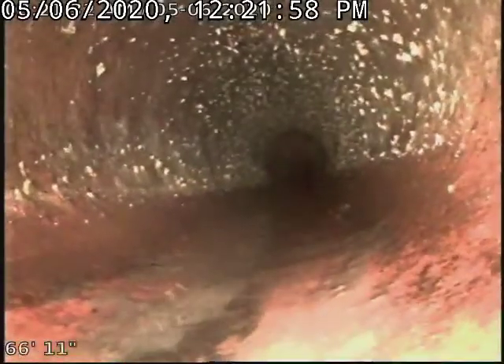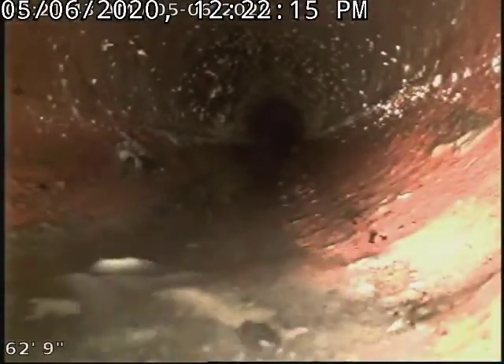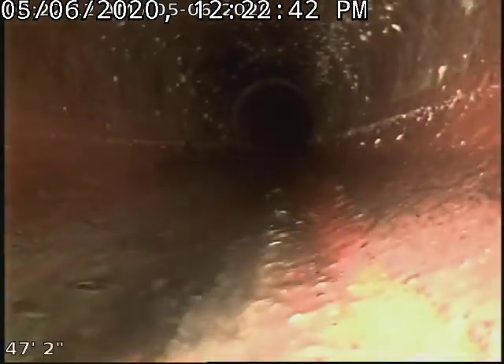Whether it was the city's backing up into yours, or yours was plugged up because of that calcium at the tail end and then it finally broke free and everything drained — you didn't see any remnants of it in your house, and you've lived here for a while. So this sort of goes for a little bit, because that ring disappears. And then these are seams — they're the hubs, the bells. You have one that you have to hop over, but it's no big deal. It's not bad. I don't think it's dig-worthy.